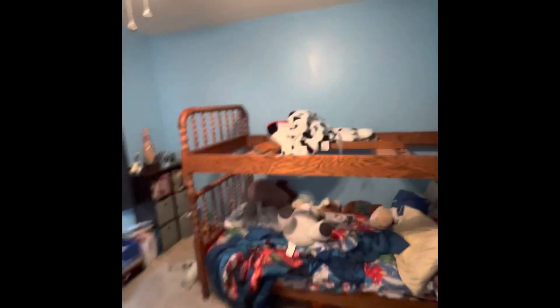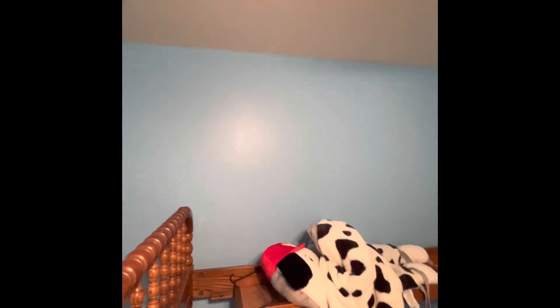Inside the Cook residence on the second floor — first room as we come up the stairwell, take a right into the kids' bedroom. Mini-split location: plan on putting it on this wall, run our line set and our drain line out the side, and the line set goes up into the attic to connect to the other piece.